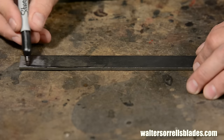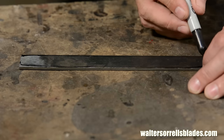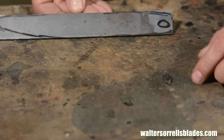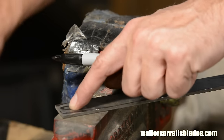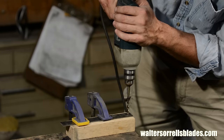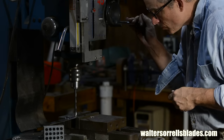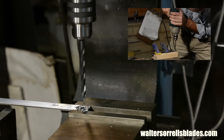I've drawn the general shape of the blade. This is not necessarily the ideal shape for a blade — I'm just trying to make something very simple that we can execute on a one-inch wide piece of steel. If I were making a more subtle and sophisticated blade, I'd probably have some finger grooves, a guard, maybe a choil, and some other refinements. But we're just aiming for dead simple. Now we're going to drill a hole right here. You can do this with a hand drill or even an old-fashioned brace and bit. Punch it first so your drill won't walk off-center. Or stick it in a Kurt vise and drill it out on the mill — three-eighths of an inch hole, though that size is not critical.